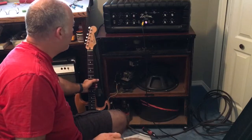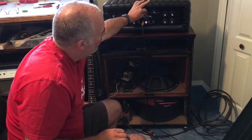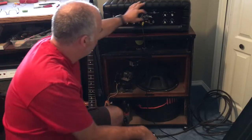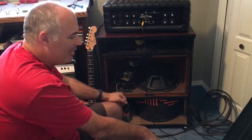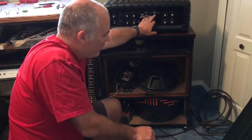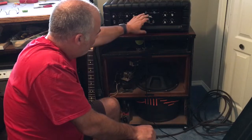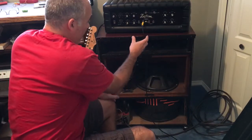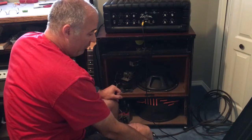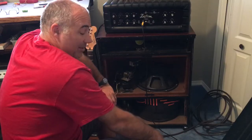The owner has asked me to try and hook up a foot switch so that he can control the speed of the Leslie. Sounds simple, but it's a little technical. There's 120 volts here that you're switching, so I'd have to set up a relay. I don't want to run 120 volts wall voltage — 120 volts, 15 amps — out to a foot switch on the floor and then back to the switch here. It's kind of dicey.